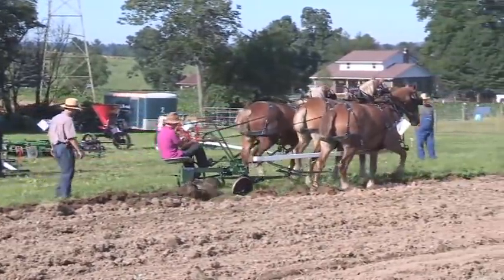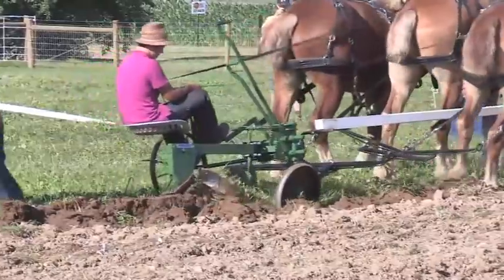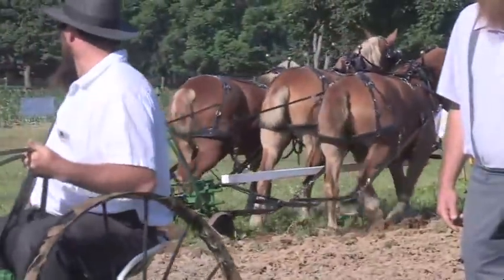That soil is just turning over nice and slow. There are times that we want a short, stubby moldboard, but there are lots of times we want that longer, slower twist — such as today, turning over sod is an ideal situation for this moldboard.